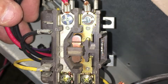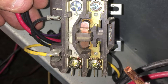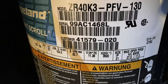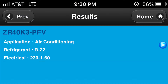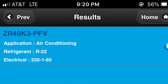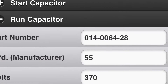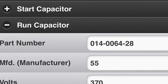You can see the contact points are really burned. 1999 unit — didn't find any loose wires. Serial number on the compressor confirms a 1999 compressor. Copeland app to the rescue again — looked up the compressor type, punched in the run capacitor: 55 MFD.